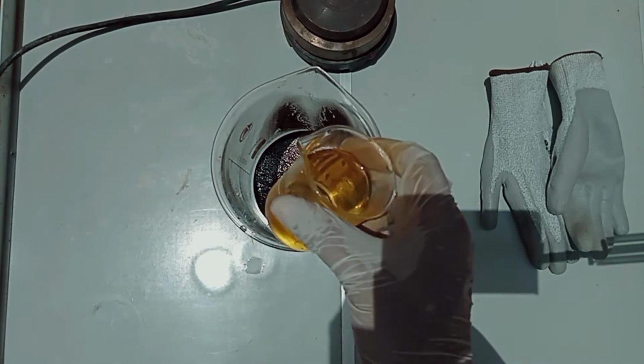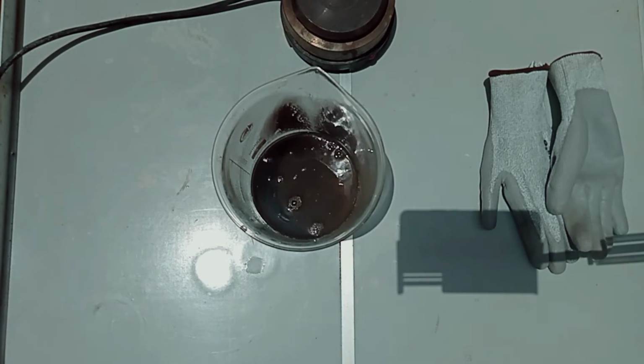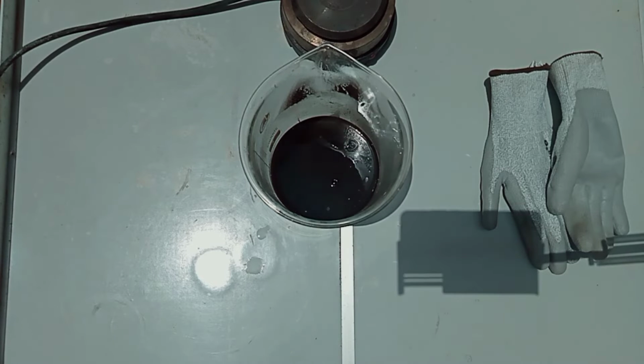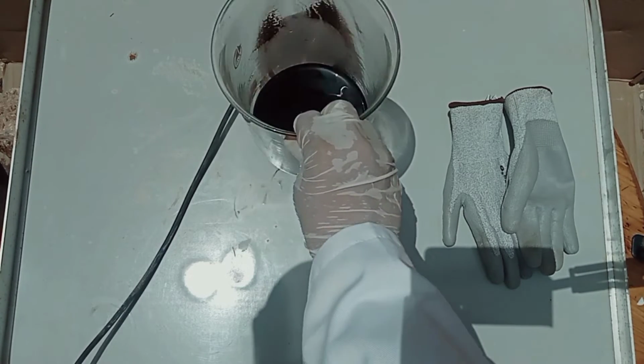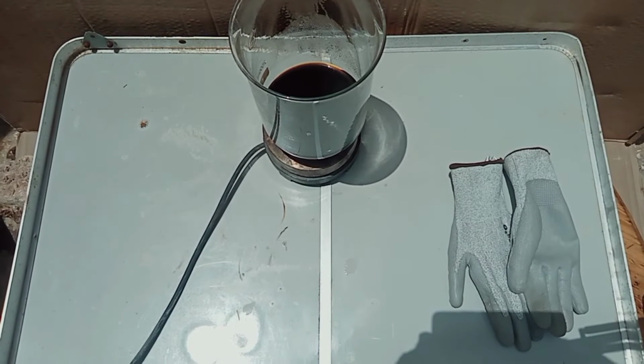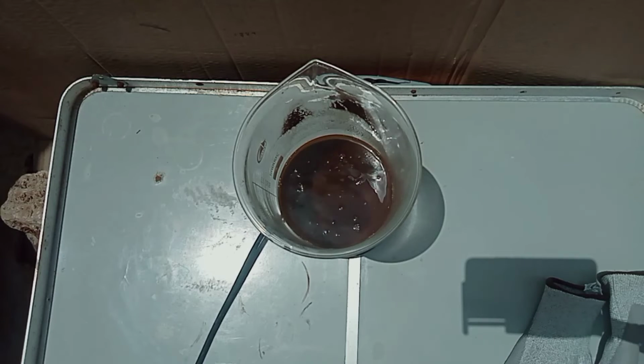Add aqua regia as a mixture of nitric acid and hydrochloric acid, optimally in a molar ratio of 1 to 3. Aqua regia is a yellow-orange, sometimes red, fuming liquid, so named by alchemists because it can dissolve the noble metals gold and platinum. Boil for 5 minutes.